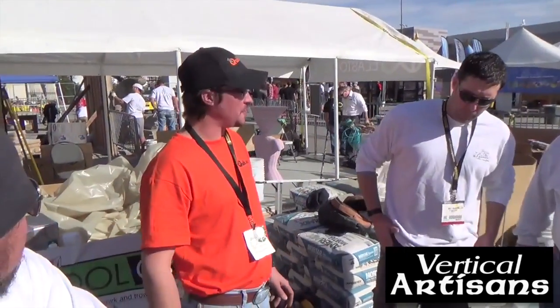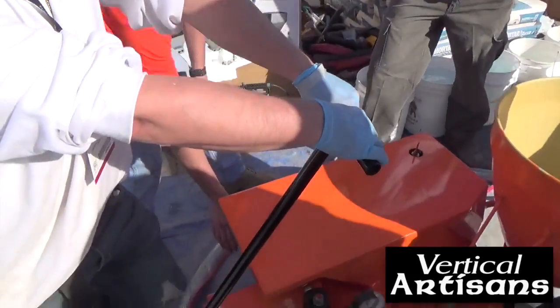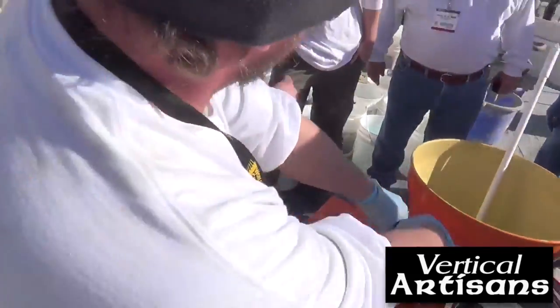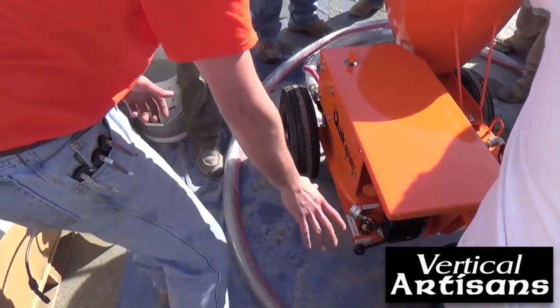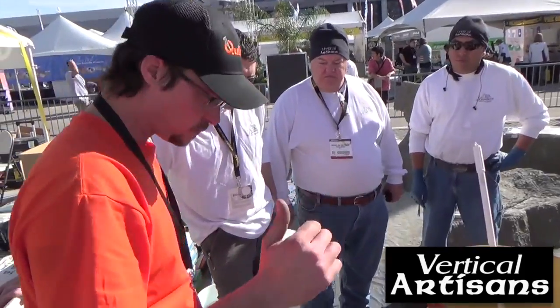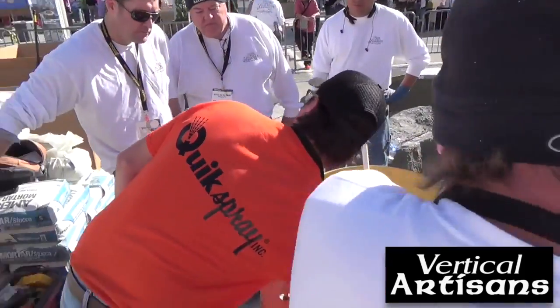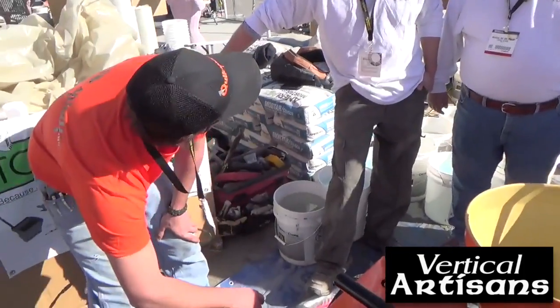What you wanna do before you fire up the air compressor is to make sure this handle's in the middle, in neutral. When you start that thing up, who knows, you don't wanna have it run away. So make sure this is in neutral. You go ahead and turn your air compressor on. After this is hooked up, let's see. That's forward, pump goes in forward.